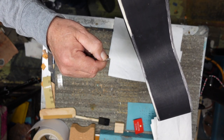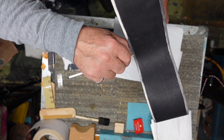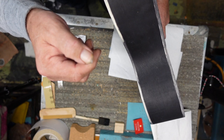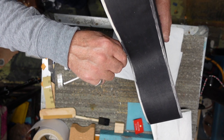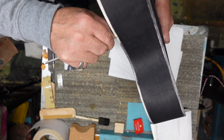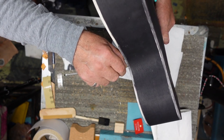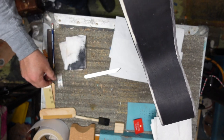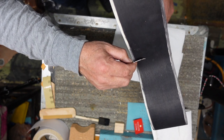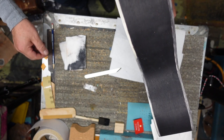So what you do is you wait for that airplane to fly overhead. But you see, I take my thumb and I put the edge of the point of the violin maker's knife right up against where the binding ends, and I do a little scrape like this. See that? And I kind of set a point like so. Now I can take a razor blade with some tape on it and bring that right up to that edge. You see that? And start scraping that off.